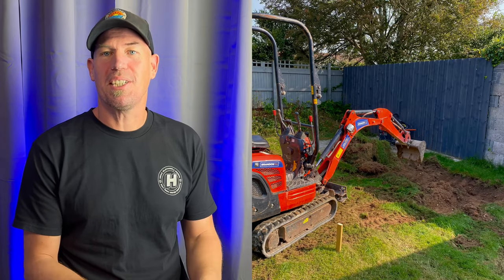Next up I entered the planning stage. My constraints were the space in the back garden and my budget — I wanted to create the biggest space I could with what I had. My previous studio was constructed from blockwork with really good sound attenuation properties, but I didn't have the skill level or budget to build from concrete blocks. A friend suggested OSB board prices had shot up, so a scratch timber build would be expensive, and the best option would be a prefabricated log cabin that I could then skin out and soundproof from the interior.